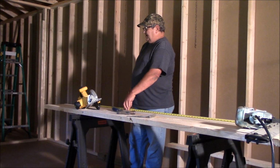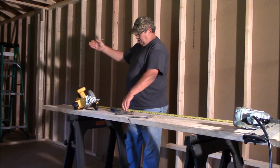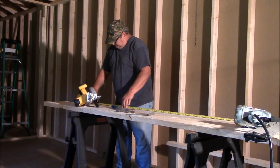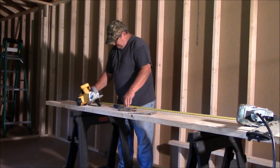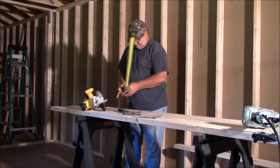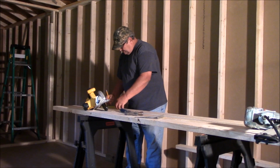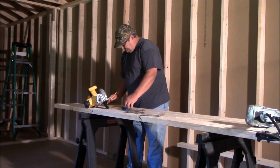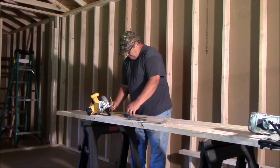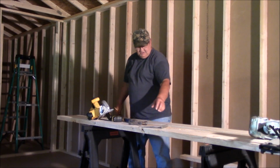Since this is going to be outside full length, the other wall is going to be inside these 2 walls. I'll have to factor in my nailer again, because it's going to get a stud at the end, which is going to go right there, and 3.5 inches will be enough. So, mark.